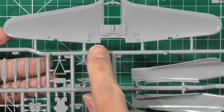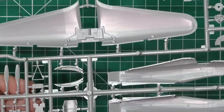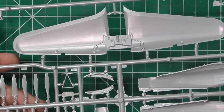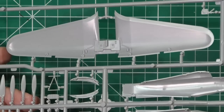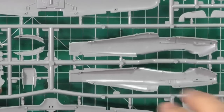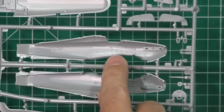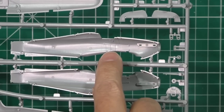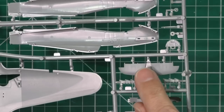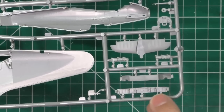On the blind side, looking for internal details. There are some locating areas but it's beautifully smooth. The moulding done in the tooling is fantastic - I'm an engineer by trade so I appreciate this work on the inside of moulds. Some companies don't polish out the moulds as much as others; this one is absolutely fantastic. Down in the cockpit, looking for ejector pins. What initially looks like ejector pins is just where it's slipping out of the mould - the actual ejector pins are tucked out of the way. That's a nice positive mark. The stressed fabric is beautifully represented as well.